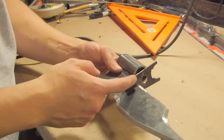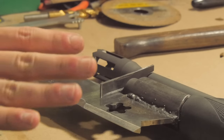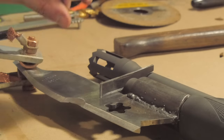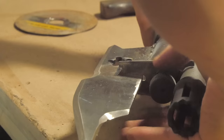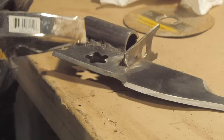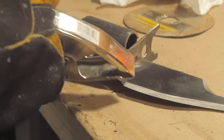I'm going to put this back on the gun with this piece on it now so that I can get it in the perfect position to do a little spot weld. I'm just going to do a couple of really quick little spot welds right here and on the other side at the same spot. I don't want to do very much welding at all on here because I don't want to risk the barrel heating up and possibly ruining the temper of it. This is just to make sure I have this piece in the exact perfect position — just a quick zap on both sides, take it off, and do the rest of the welds. Now I take this off, clean this up, and complete the welds. This is harder than the regular welding I do because this piece is so thin compared to this, so getting the settings right so you don't melt through it is really difficult. Sweet, I'm almost done — I just gotta clean some stuff up with this flap disc.